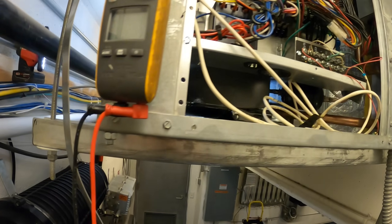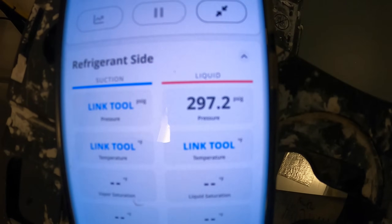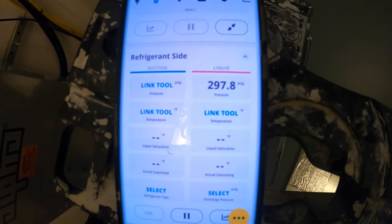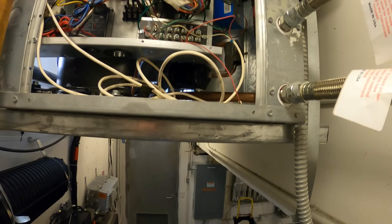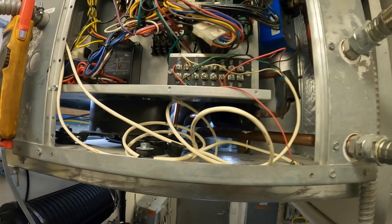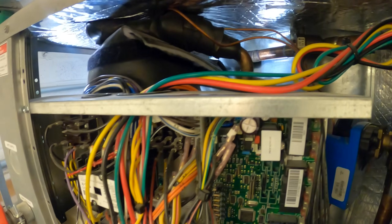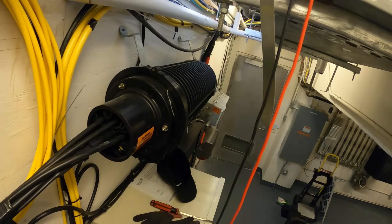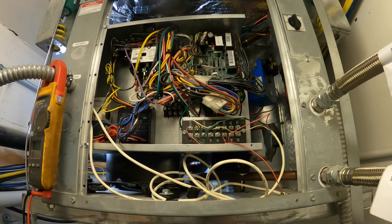And the fuses — that ain't the first time I've seen that in this building. I already know the last guy was here. Why is that just disconnected? Open circuit. I'm going to see if this is 410A — it probably is. Head pressure seems okay. I ripped off the filter. Let's check pressure — it's extremely difficult to get to the suction line. This is just such a bad spot. This thing is hacked to death and I got to figure out what's going on.